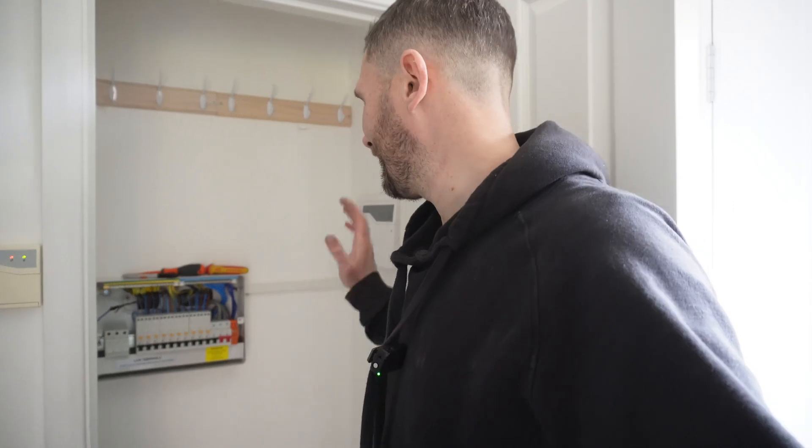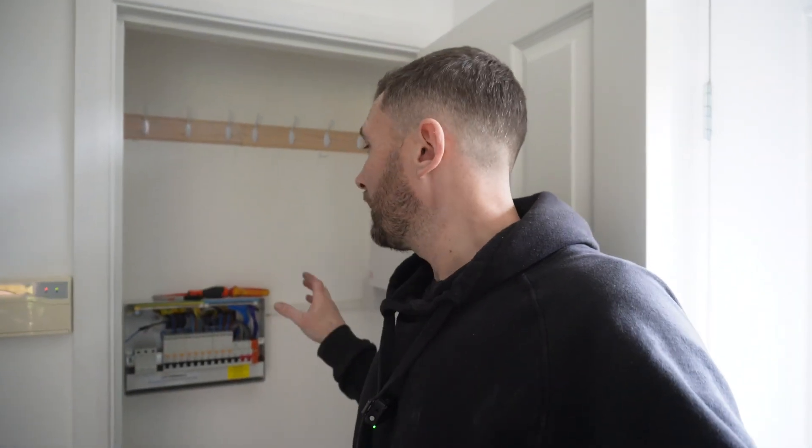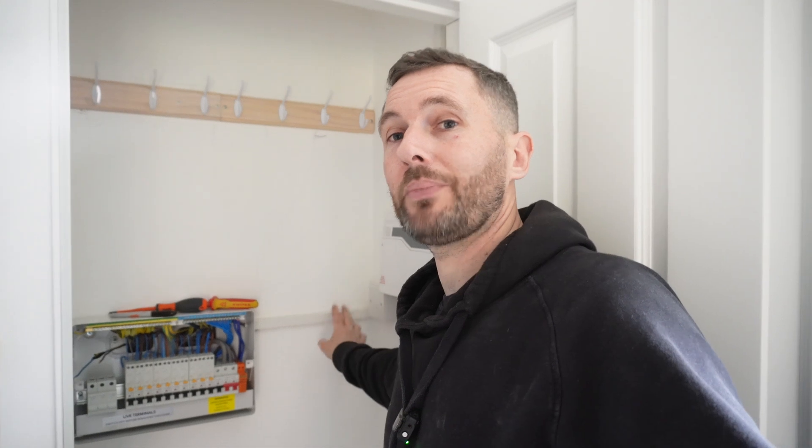The board is in - basically it's functional now. I've got the power back on. I've now found that spur down there and taken the 16 amp RCBO for that because I've separated it. I've got to now fit another 16 amp RCBO for the immersion. I've had to extend a lot of the cables - the earths I've had to do anyway, not great. I've replaced the bit of trunking for the alarm and rewired it because it was too short. We're onto testing now.